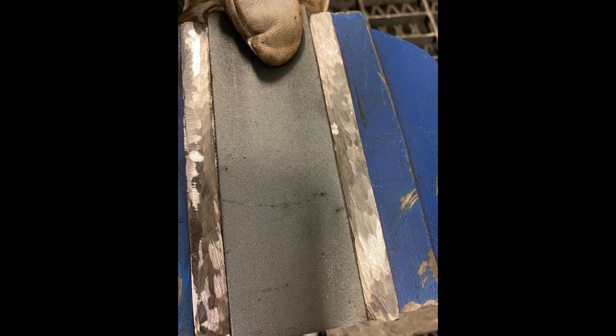Hello and welcome back. Today we're going to be working on 5mm hot rolled steel. The first action is the cleaning action, where we're going to use a grinder to grind the points where we're going to be welding.